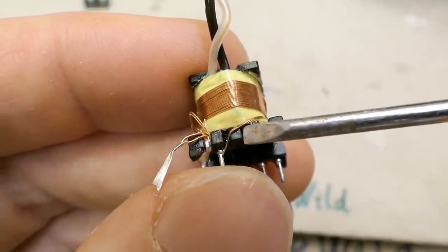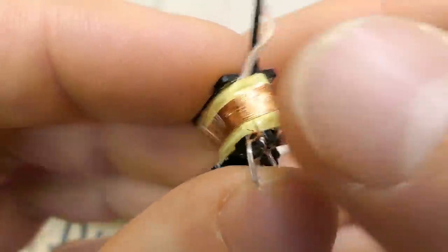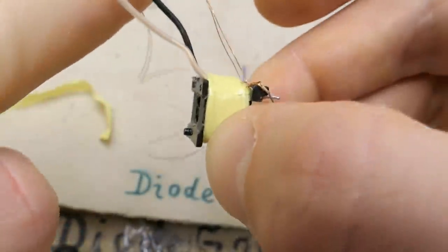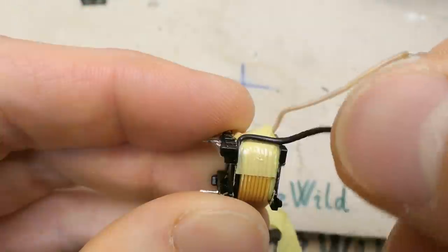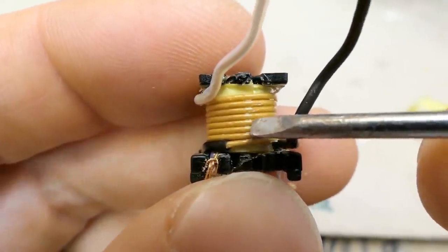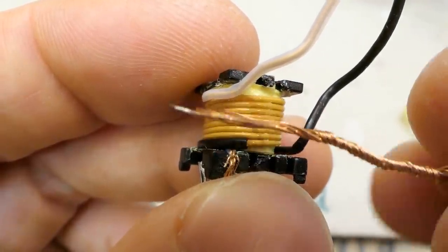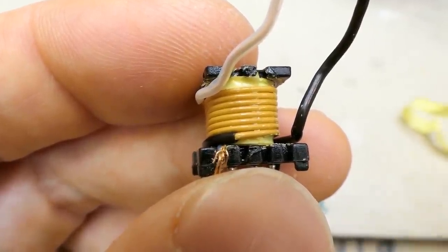The secondary terminals have a thick insulation on them. The critical point is where the other windings are underneath, but they are hopefully spaced from it. Cutting reveals two wires in parallel — unwinding and counting gives 13 turns. Then there is an insulation layer with no gaps, followed by a second layer, and then this secondary winding. The secondary wire has a safety insulation — this yellow insulation is much, much thicker than the normal lacquer on transformer wires. Most transformer wires have a very thin lacquer with a copper color, but this one has a thick safety insulation that is probably orders of magnitude thicker.